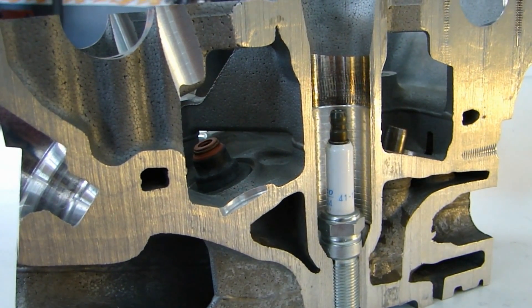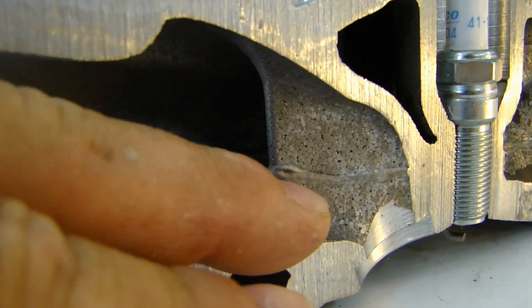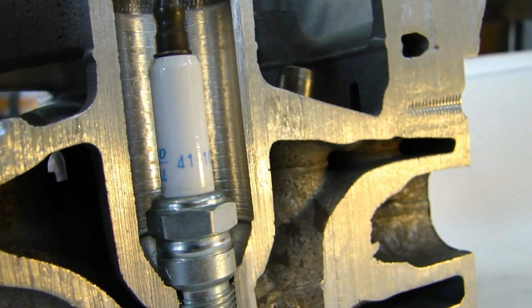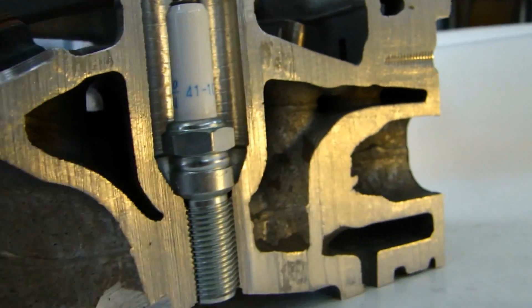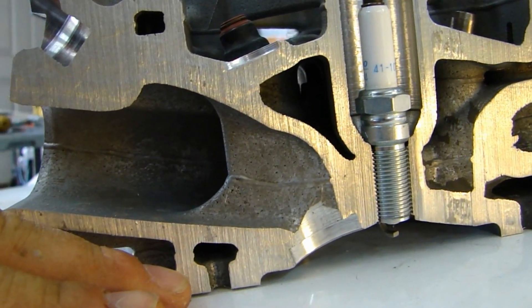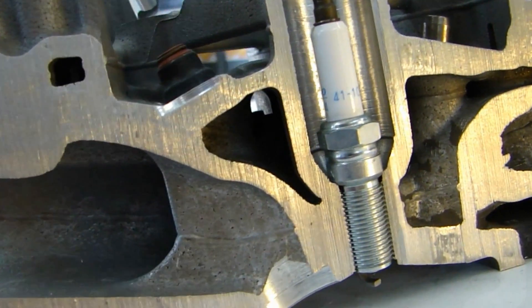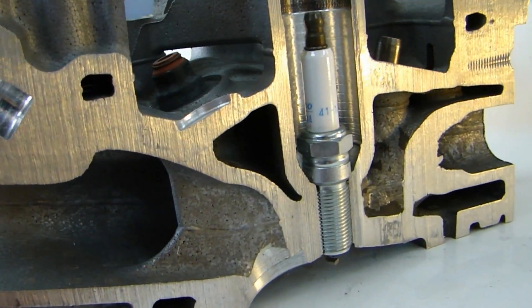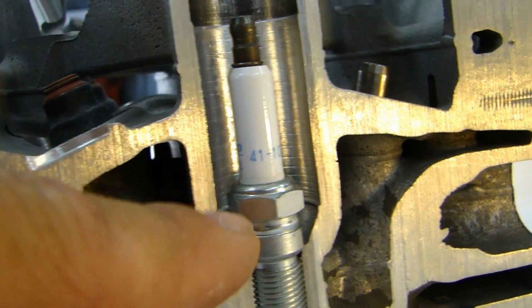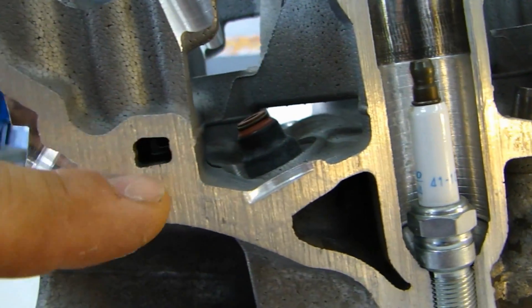If you remember, when I had the foam part in my hand, I said the foam part is the mold for the cylinder head. I said remember those parting lines where the glue is. If I come in here and look real close, you can see here's a parting line right here, and up here there's a parting line right in here — which is hard to see but there's a parting line right there. There's a parting line right down here and right in here. So if you were to look at this and count, we have the pieces of the foam: one is down here, the second part is right here, third part right here, fourth part right through the middle, and the fifth part is on top. You can see the actual parting lines are where the foam was glued together because it's cast right into the aluminum. That's how the Lost Foam method works when you cast aluminum parts — that method is used because you can see how complex some of these passages are and you wouldn't be able to do this with regular casting. That's why they use that to make cylinder heads because the insides are so complex.